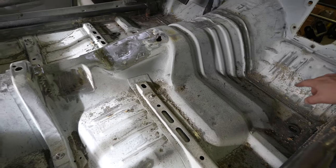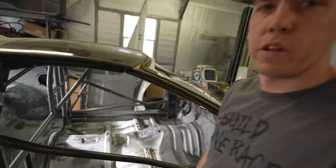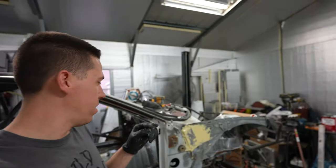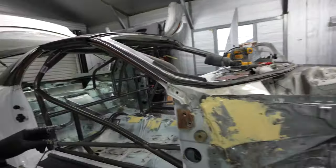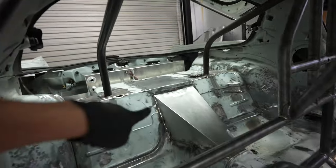This thing is an absolute mess now from grinding all the body filler and that crap — I still need to get a little bit, but otherwise everything is pretty much sanded with 80 grit or wire wheeled to get rid of all that extra crap. Holes are filled and sanded. This long drawn-out process is trying to prep this thing to paint the inside with ceramic Lizard Skin.